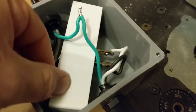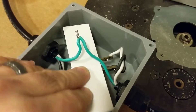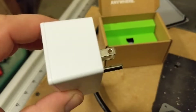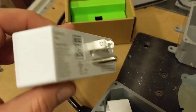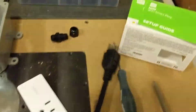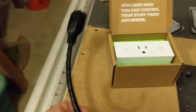The grounds are just tied together. On the input side — most people in the US and Canada know that these plugs have a small hole in the prong. Let me show you on this one. I use that to my advantage when soldering — I put the wire right through that hole and solder it right to the prong. So you've got your 110V coming in, and the switch is switching the 110V going out.